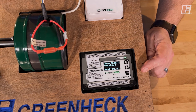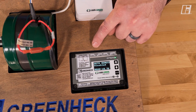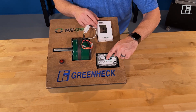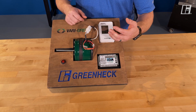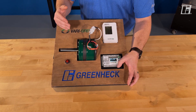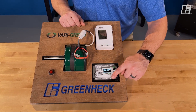The next mode is auto remote. Again, auto is looking at the auto terminals. The remote part says to look at the control terminal for the speed reference — that's where you're getting your speed reference from something remotely. In this scenario, the Very Green temperature-humidity controller is providing a 0 to 10 volt signal. Right now it reads 10 volts, telling it to run full speed, but the fan isn't running because the auto inputs haven't allowed it. Think of a time clock that says to control the temperature in the space only during 8-to-5 business hours. When the time clock makes the circuit, the fan is now being controlled remotely by the remote speed reference and the on/off command.